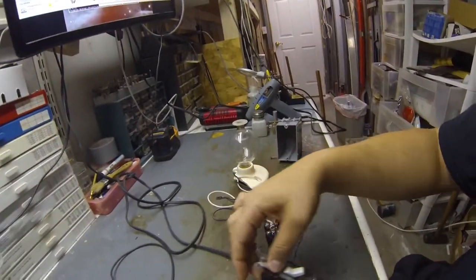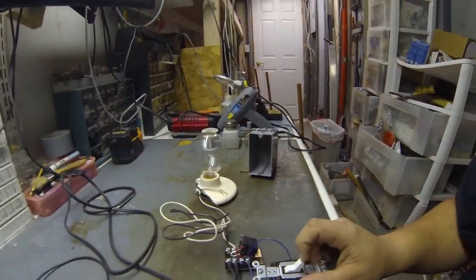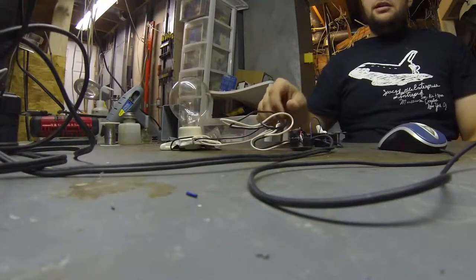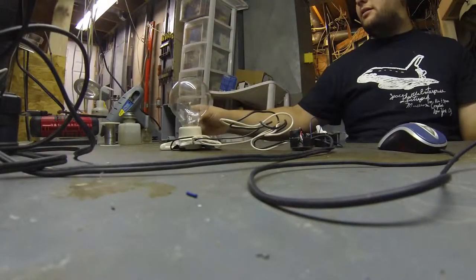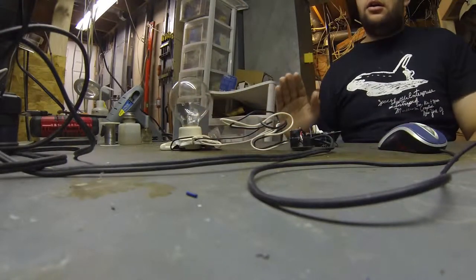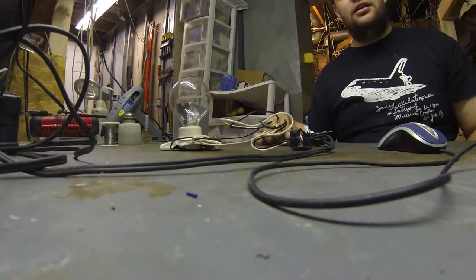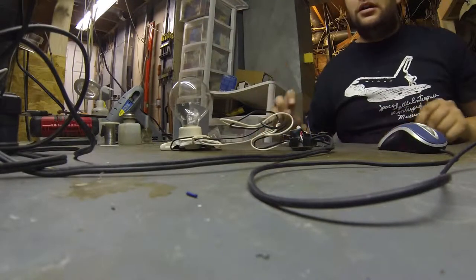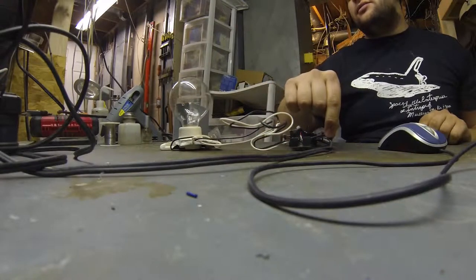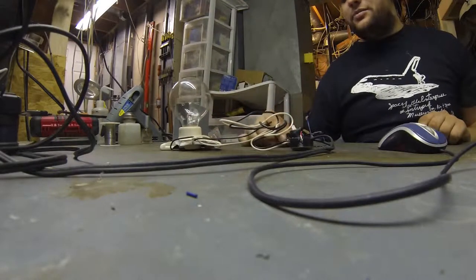Essentially we still have the physical switch, which is capable of turning the light on and off. You would put this board behind the switch in the box in the wall. Right now it's only capable of doing single switch outlets — if you have a multi-switch outlet it will not function properly, but the second version will. It also does not have any zero-crossing detection for the incoming AC, so it's not capable of dimming the bulb — the next version will.